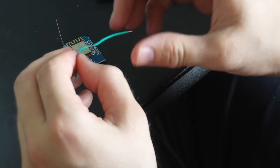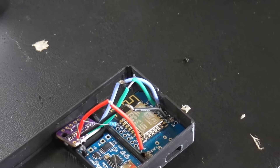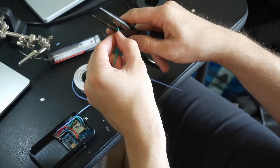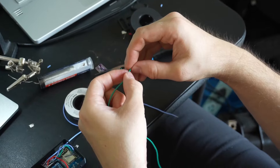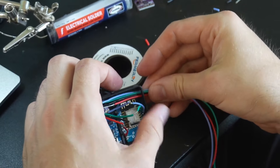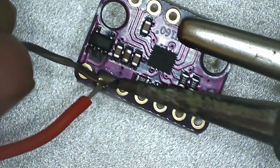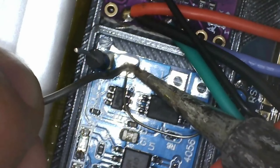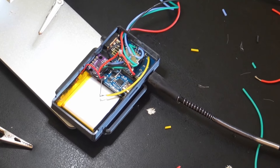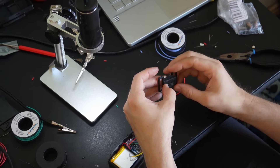The only difference is that we need to splice the wires attached to our first IMU to go out and attach to our second IMU. To achieve this, expose the middle portion of your data and power wires. Then run a length of power and data wires in through the back of your printed case — I'm going to be using the length from my ankle to my foot for this tracker. Next, just wrap the wires around the ones that we had exposed, solder into place, attach the new wires to your secondary IMU, and continue building out the tracker as you would any other tracker. For those joint points, I would suggest using either electrical tape or a hot glue gun to seal those up so you're not shorting out anything inside the case.